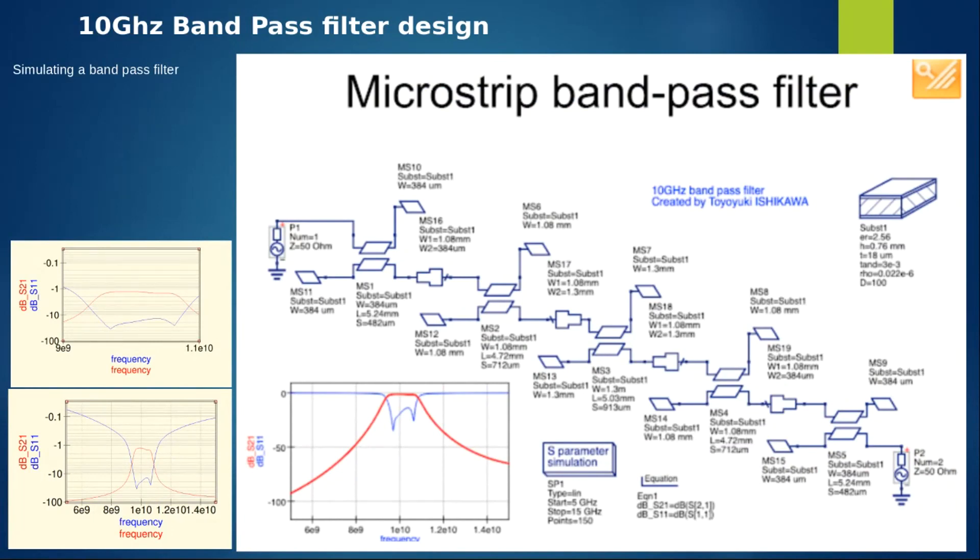I did simulation comparisons between a pipe cap and this microstrip board, looking at the bandwidth you can get. You could probably add another two stages to this filter and it will be very similar to a pipe cap, maybe a little bit narrower. The pipe cap can also be modified by adjusting the length of the little pins to vary the bandwidth. As for why we need the filter on the transmitting side - it's purely to get rid of the primary 5 GHz signal. There wasn't a lot of noise around the 10 GHz signal, so 100 MHz bandwidth from the pipe cap should be good enough.